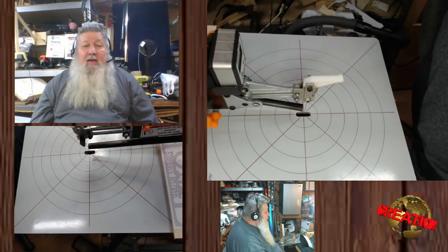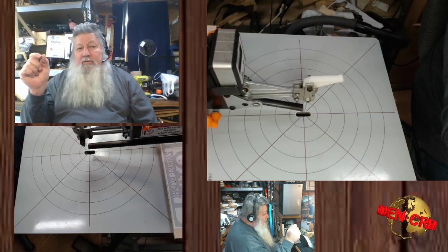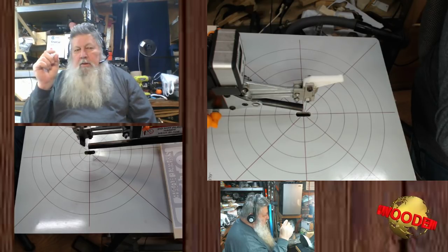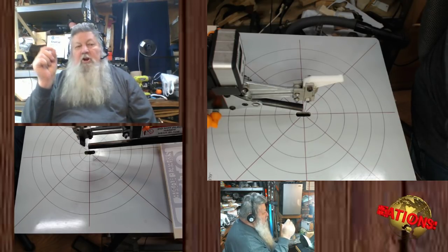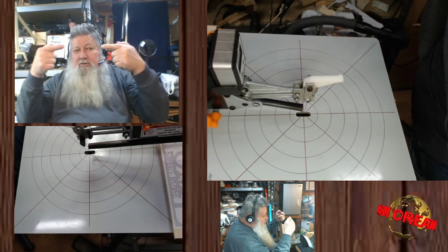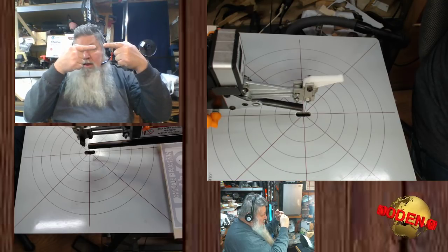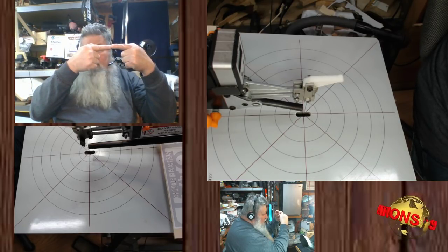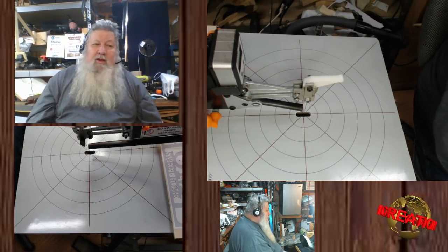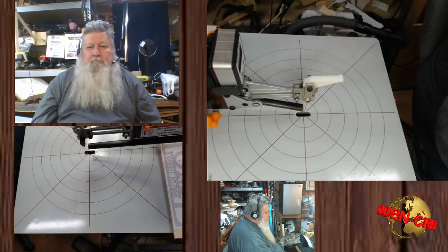Yeah, well, he might not have had the blade aligned in the center of those jaws, so you need to check that. If he's got it good and aligned in the center of the jaws, you have a set screw on one side and then the blade holder on the other, and they're supposed to meet in the middle. Well, if the set screw on one side is backed off some and the blade holder screws over to meet it, then it could be wearing on one side of the hole and not the other because the blade's not totally centered.